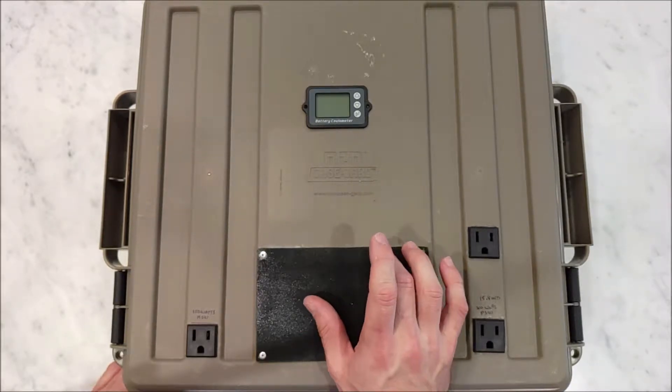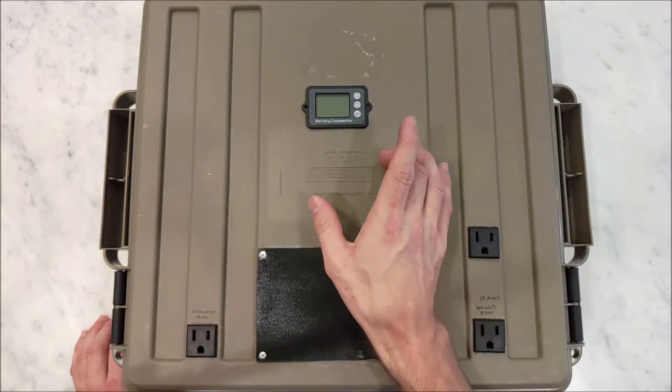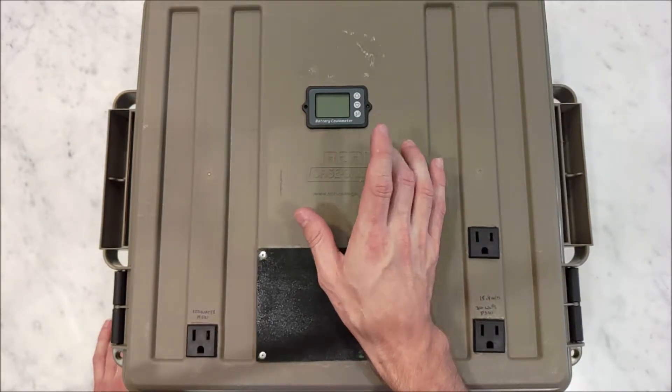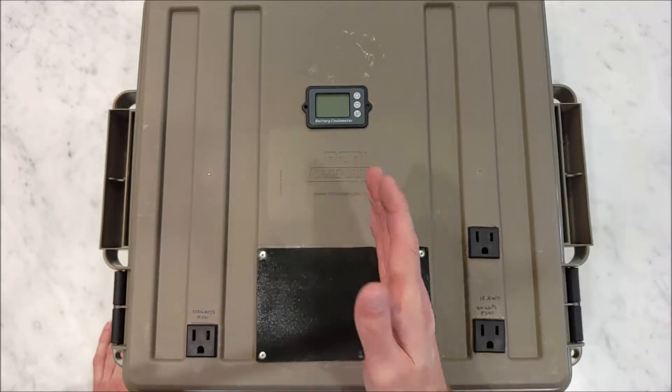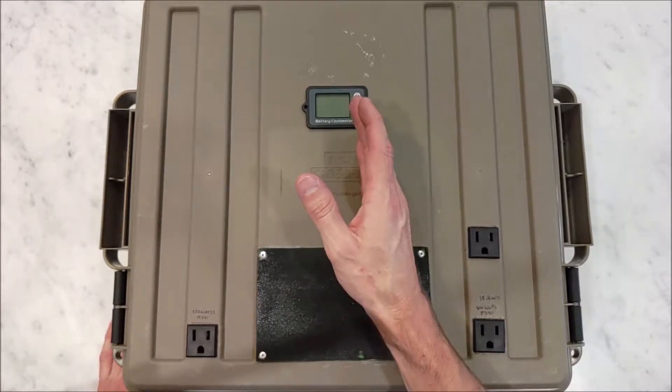The reason is a car inverter normally has a range from 10 to 15 volts, and a 3S battery will want to go all the way down to 9 volts. So the inverter will cut off before you run out of battery power. Same with a 4S.